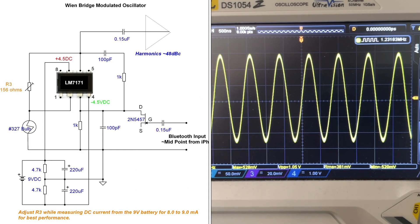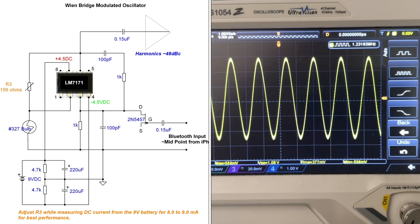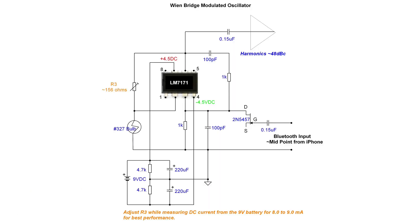As designed, I'm just north of one megahertz. I added modulation using a 2N5457 JFET, feeding the signal back in through a capacitor into the gate of the JFET at about midpoint. So I thought I'd share the design with you folks.